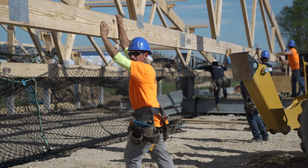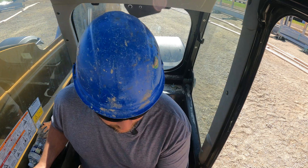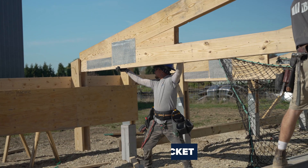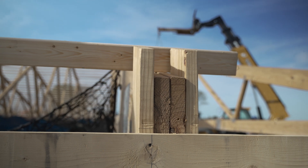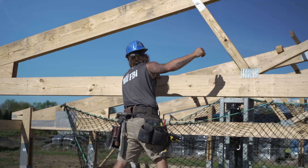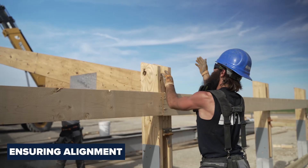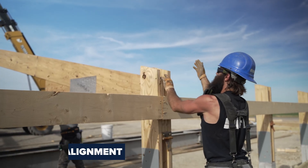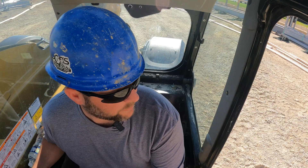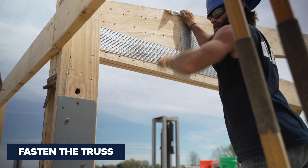Which means I have to be about perfect with these guys and in sync with them. Now I'm just going to ease it down onto these pockets here — lower it down real slow. Sets perfect right in that pocket. I'll wait for my signaler Neil. Neil, am I good in and out? He's going to tell me if I'm good in and out, make sure that truss is sitting as straight as we can when we put these temp liners on. He's giving me the all-clear that we're good, so now we're set and these guys are going to fasten this truss.